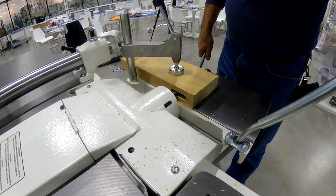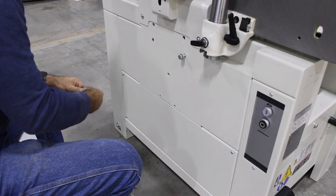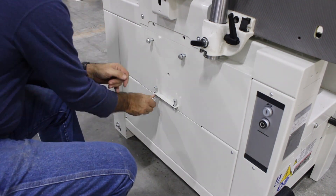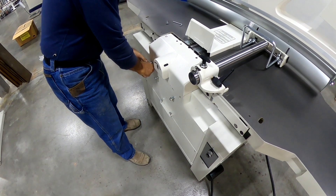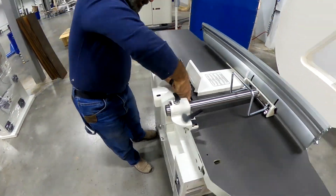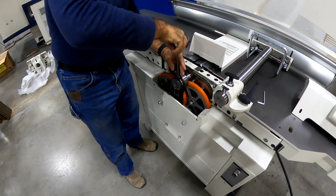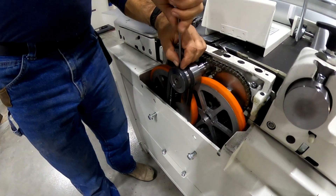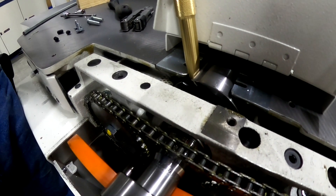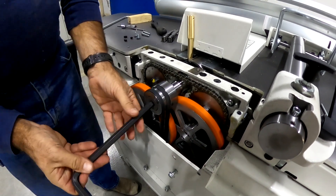The mortiser — let's install it. The basic hardware: leveling plate and the bolts that hold the mortiser to the frame. I find it easier to install the chuck first before hanging the mortiser so you're not banging your knees on the mortiser while you're installing the chuck. Take the cover plate off to expose everything. It has two set screws on that bolt that you're going to replace with the chuck — loosen those up and back that bolt out. Things always loosen in the direction of the knives in terms of rotation, so I use that brass gib to lock the head and then loosen that bolt and take it out.